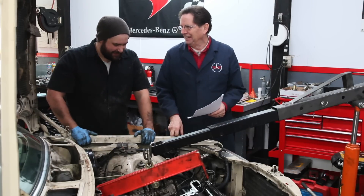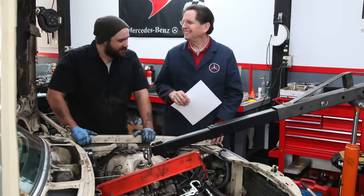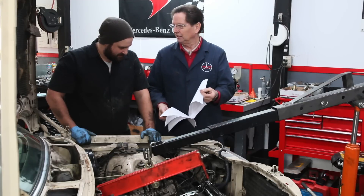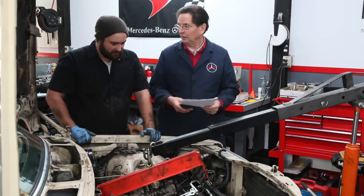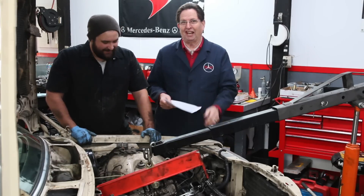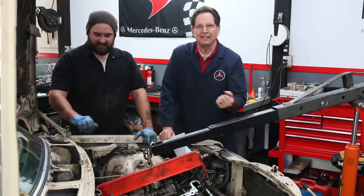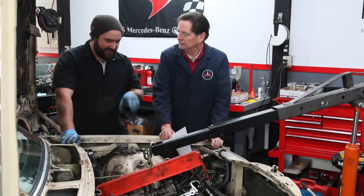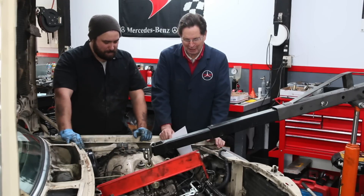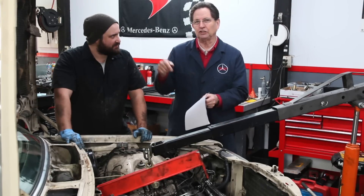I know you really didn't want to have to take another fan off. This is like the third turbo diesel engine you've pulled out in the last few months. What did you learn from pulling this one? Always use the checklist. Even if it's the third one you've done recently, you're going to forget something. I created a four-page checklist of everything you need to remove when you go to pull one of these OM617 turbo diesel engines. Ryan kind of felt like, who needs a checklist? I might have been a little overconfident. This time it was the engine shock top bolts, the AC line on the passenger front, and the speedometer cable. So if you're ever going to tackle this job yourself and remove one of these diesel engines, this checklist I created is available free on my website — I'll put a link in the description below this video.